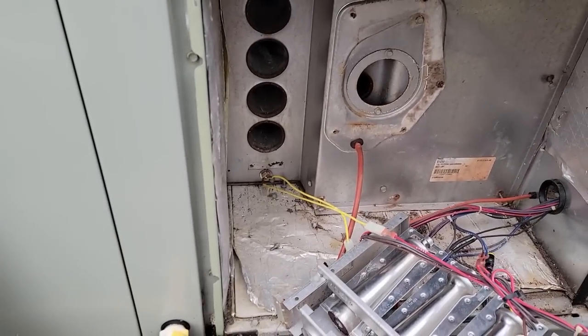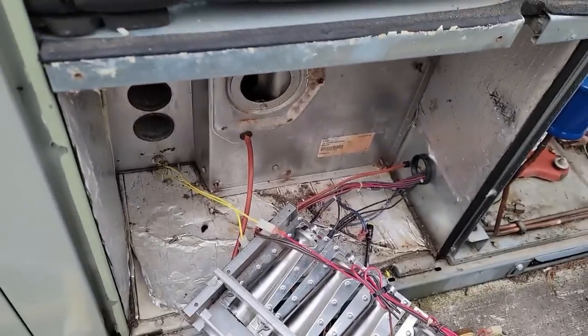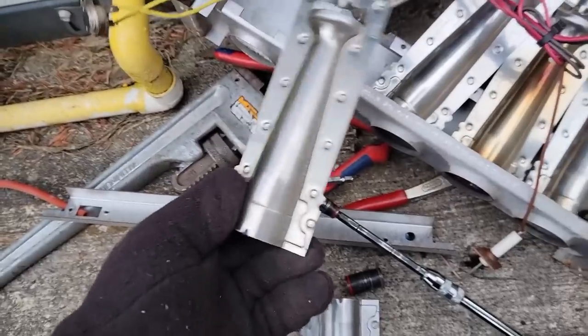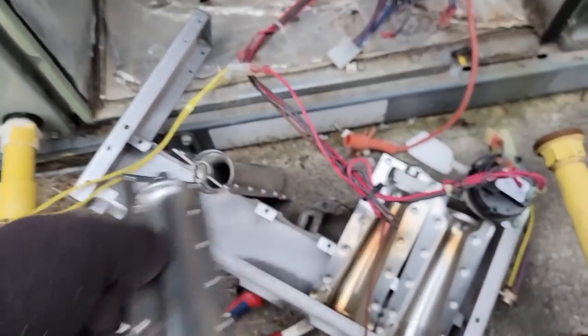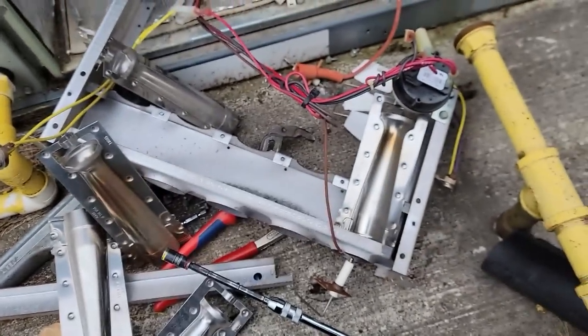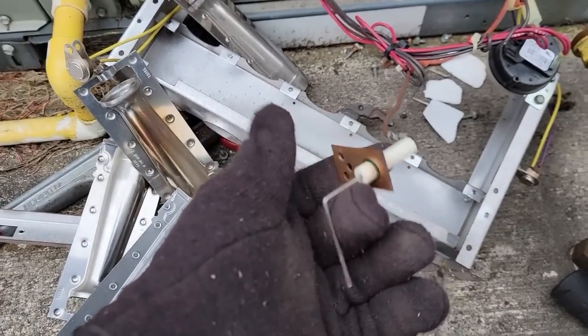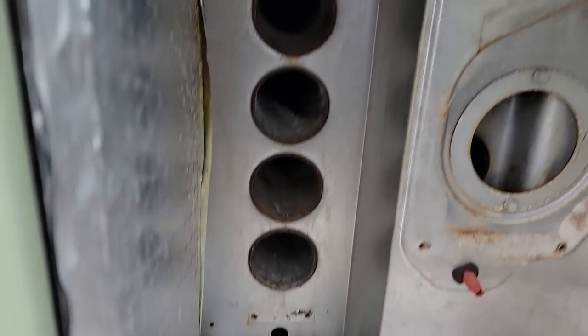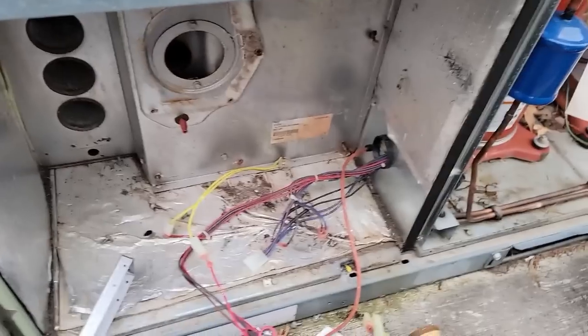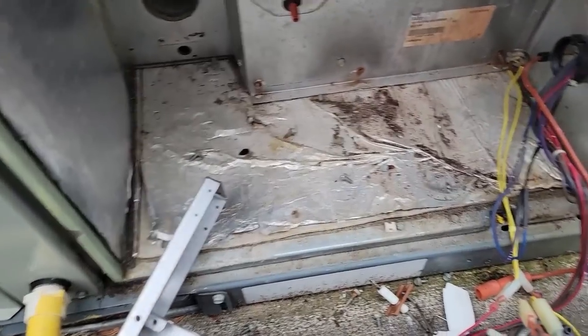Got a roll-out switch there — got it unhooked and finished taking out a few more screws around the corner. Hopefully this thing pulls right out, but I bet it won't. We got the burners undone. You can see they made them out of some nice shiny material, but that part there isn't the greatest — some look worse than others. Went ahead and ordered new ones; the new one looks much better. We'll get those swapped out and put the igniters in right before we slide it in so I don't get them broken. The limit switch came right out and just got a few more screws to go.